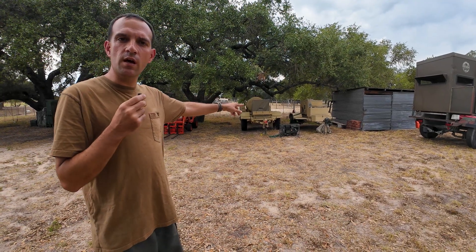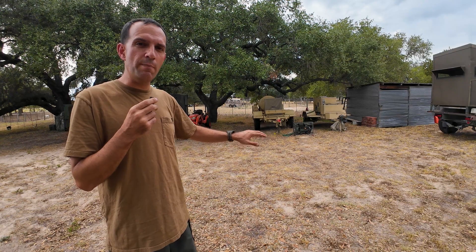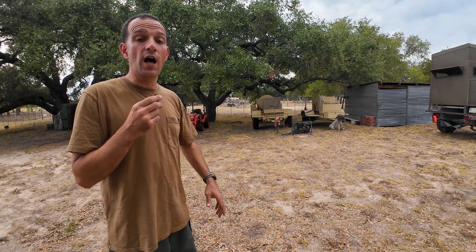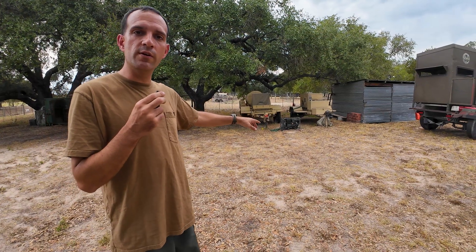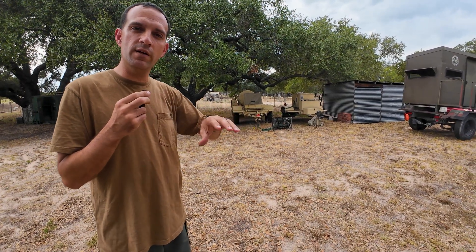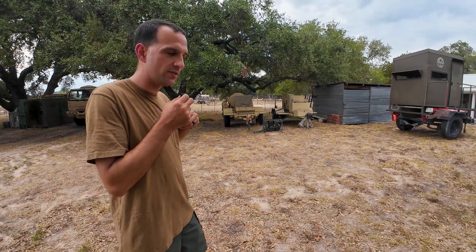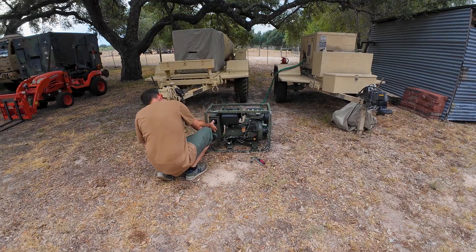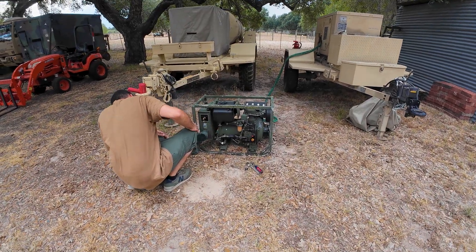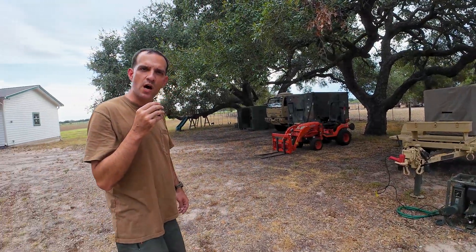I have just a heat gun hooked up to it — 110 volt — that should be about a 75% load. What I'm going to do is go close the contactor. You'll hear the generator load up a little bit, and then you might hear it stutter again. Sometimes they don't; sometimes it does clear itself out. It didn't even seem like it stuttered that much compared to some of the other ones that I've done.